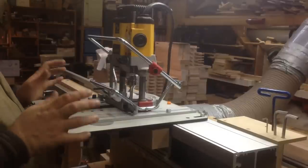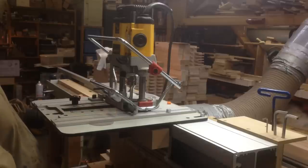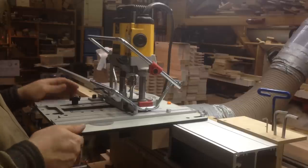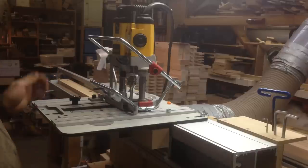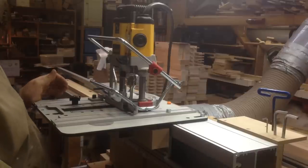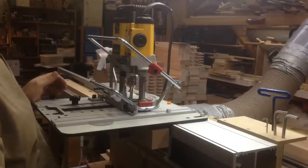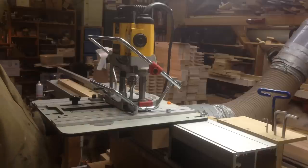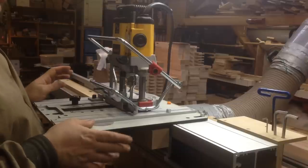I'm going to make a short video on the Wood Rat. I've got it set up with a mortising rail and a thing I made down here that has stops, so I can do all these legs repeatedly. I've got the mortises marked out using the cursor. On the bottom side I have a new rail that I put on the bottom of the Wood Rat — a curtain rod rail — and I've made little stops so I can use the attachment on the bottom of the mortising rail to repeat all of these mortises quite effectively and easily. Making it was a little more difficult but it seems to work pretty well.